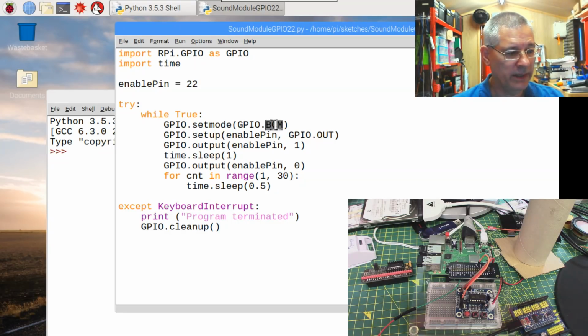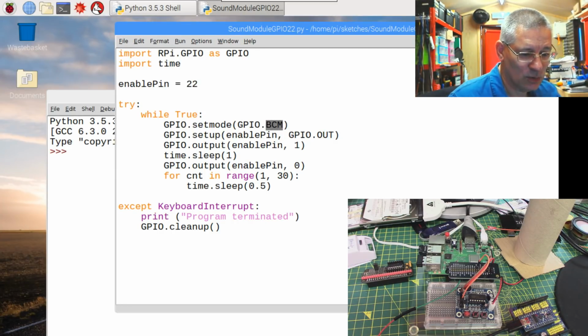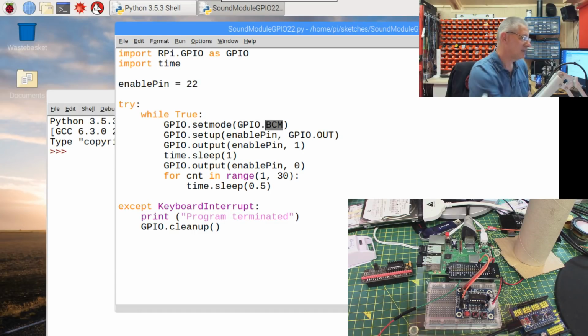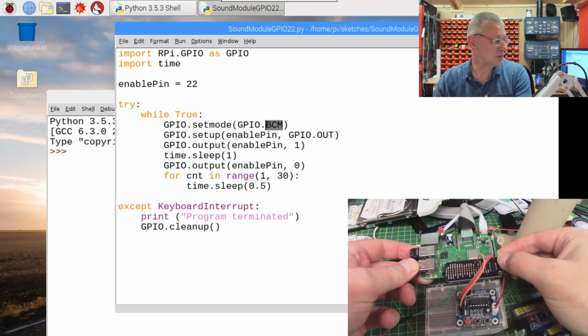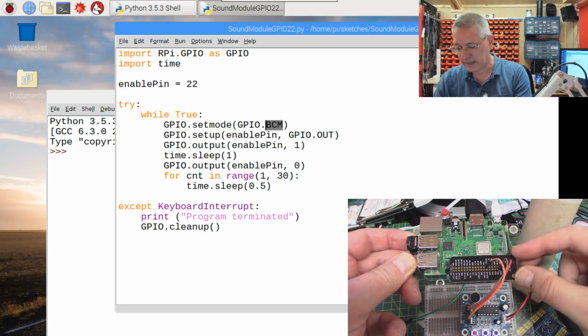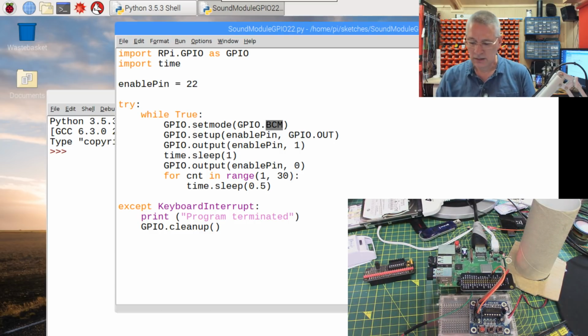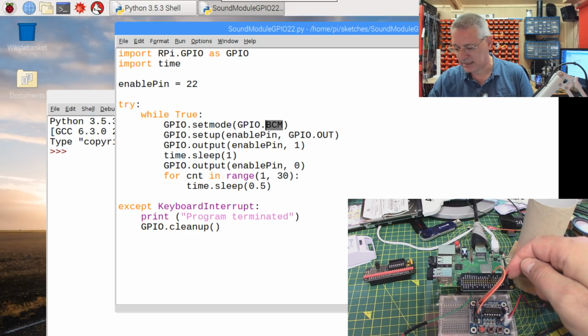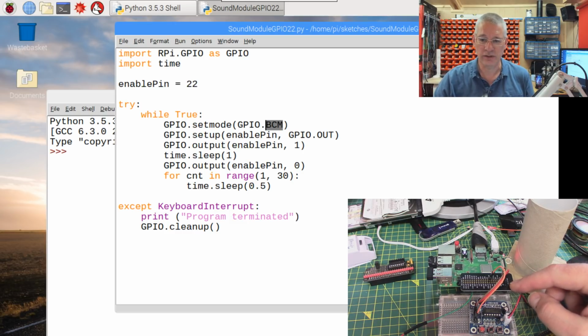Let me show you what I mean over here on the workshop again. Oh, that means I really must get this automated, all this camera faffing about. So there we are, I'm over here now. You can just about make out this little board I've got on here, that slides over the pins so we can tell what each of those pins does, because otherwise they're just numbered and you've no idea. The convention is to use the pins as in the Broadcom chip numbering system rather than the board numbering 1, 2, 3, 4, 5 serially, because I guess the board pins could change at any time, but the convention won't. They'll always stay the same.